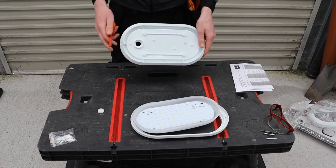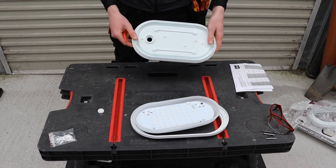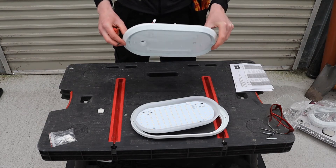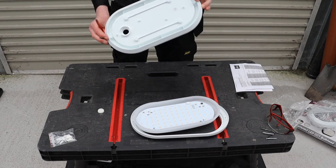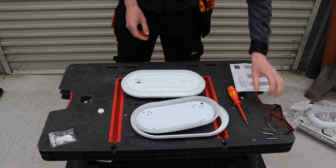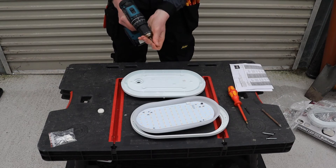In this example I'm going to be using these four plastic insert holes. What I typically do is drill four little pilot holes, which allows me to insert a screw through the pilot hole and drill into the surface — whether that's timber, plastic, or concrete. For concrete you'd normally use an SDS drill, but in my example I'm mounting this on the fascia of the house, so standard screws are fine. I put on my safety glasses, get a drill, and use a small drill bit.